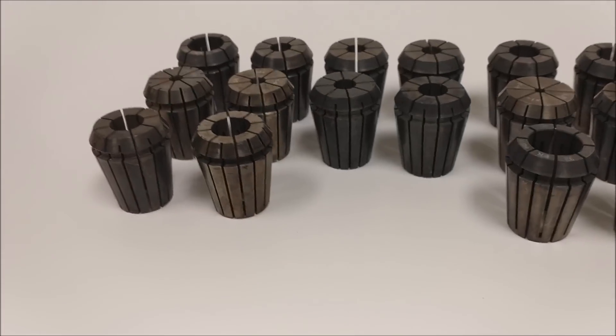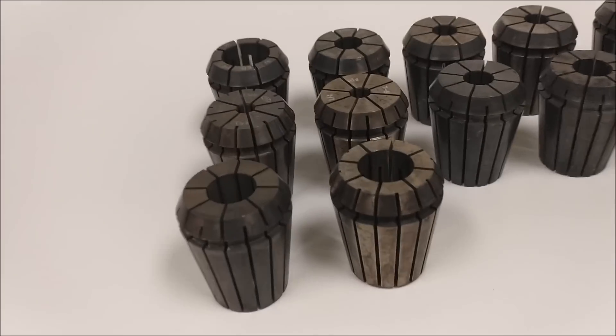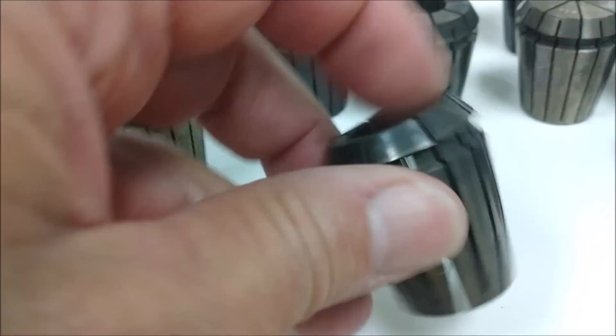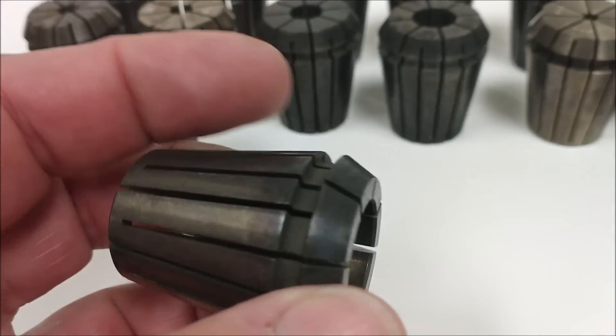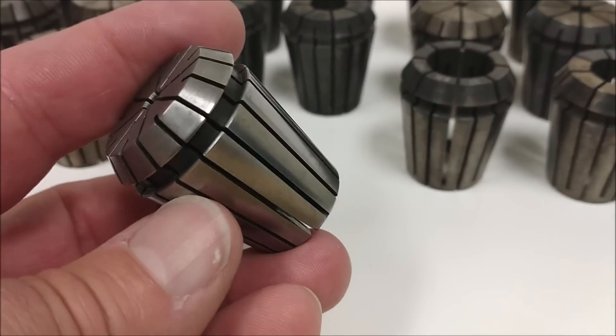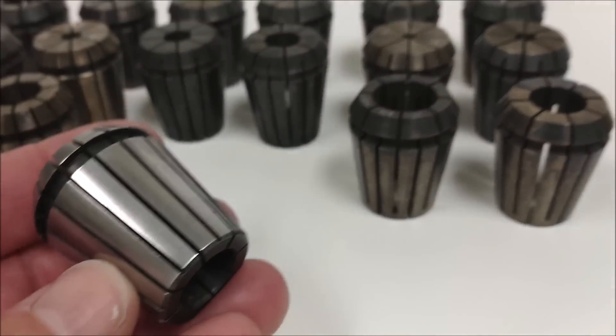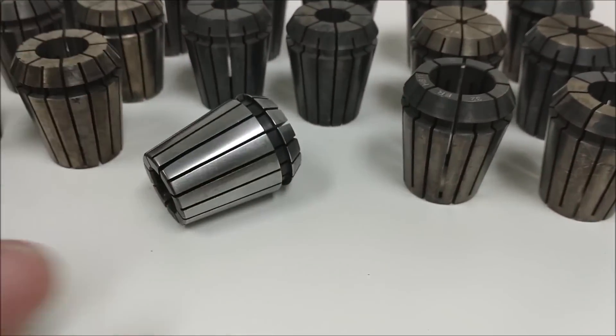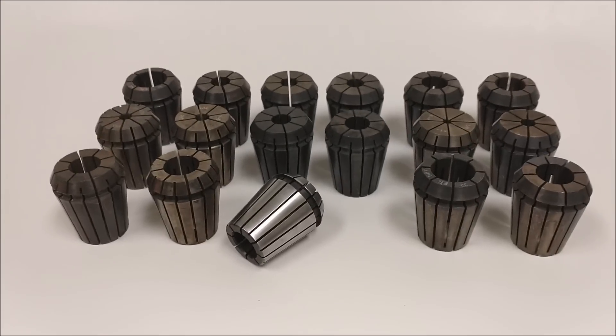Let's take a look at what this CRC product did to my collets after about 13 hours. These collets look like they have been through a barn fire — they are blue and have discoloration that looks like they were subject to extreme heat. You can see how it goes gold and blue. This is what they look like now, and this is what they were supposed to look like before — just some superficial rust on the face and around the nose from using a water-based coolant.